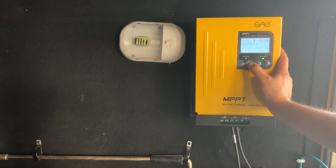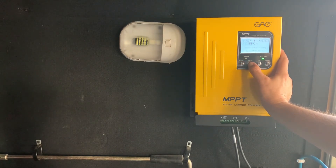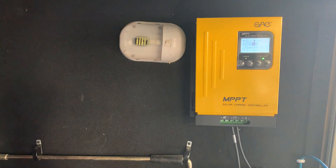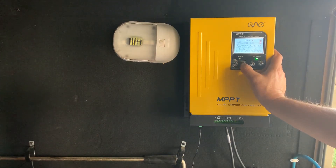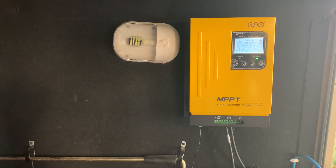Let's go back to system info. AGM - charged voltage. I guess we'll probably have to go through parameter settings. So I've got this set up now. The battery selection only allowed me to select lithium ion, and these are lithium iron phosphate batteries, so I went with the lithium ion selection. Let me change a few parameters - the over charging and under charging - and we'll see how that goes.